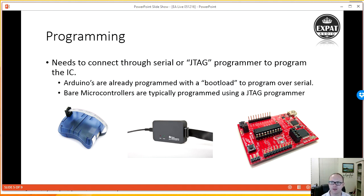Now, what we're going to do with these boards is use this MSP430 Launchpad, which is actually used to develop code on itself. It's got a section of the board that's actually a programmer. So this section here that you can see me highlighting with a mouse does the same as this board here. You can basically remove this chip, and I'm going to bring signals up from the programmer. I'll bring power, the programming signals, and the USB serial port data up to the board.